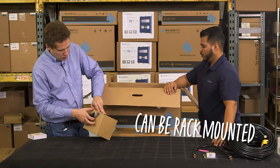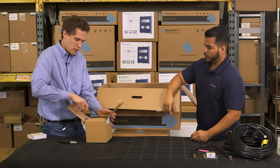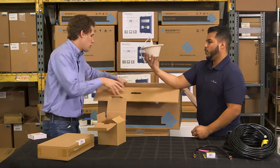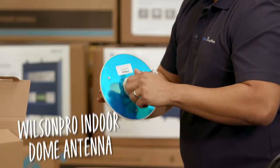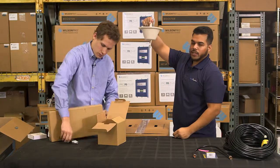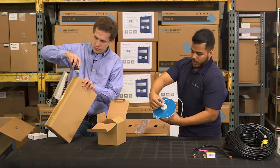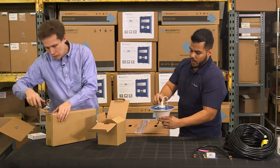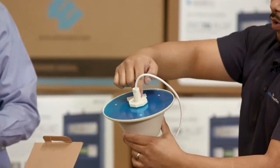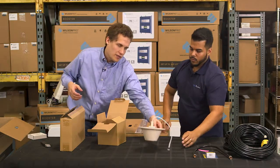It will actually fit really well in an IT closet if that's what you want. We also have this indoor antenna — a pretty standard 4G dome with a simple screw-on, screw-off collar. Great for drop-ceiling applications. You basically unscrew the collar, bore out the circumference of the stem, run it from the bottom up, put it against the drop tile, then thread it from the back — basically a sandwich. Plugged into the booster and attached with that cable.